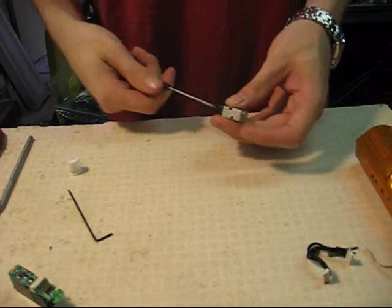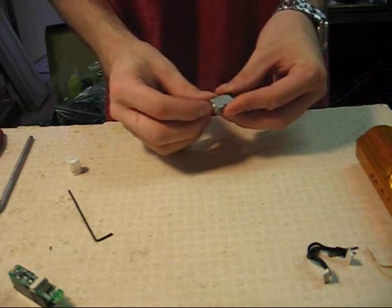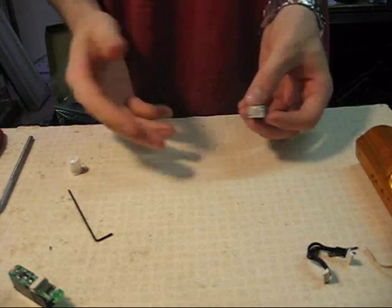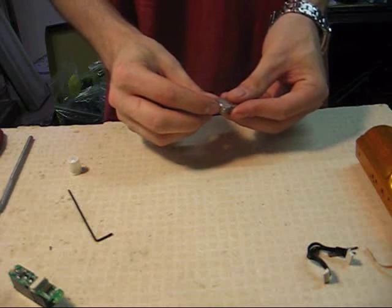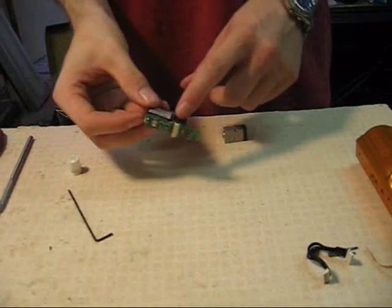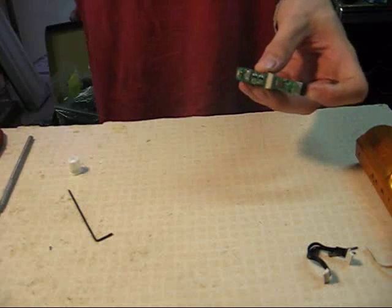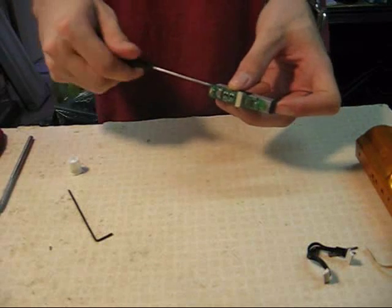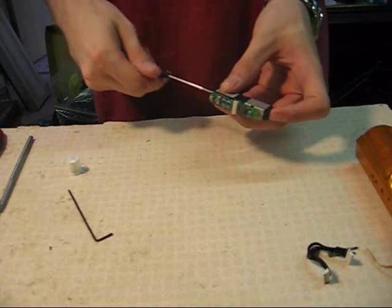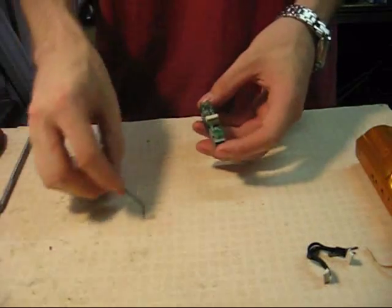With it in position, just screw the screws back down. You can test it to see if it works by pushing in on the other end — it should spring back slightly. It won't spring back a lot; it might not spring back at all, but it should move a little bit freely on its own. Now take the remaining parts of the solenoid — the pilot and the coil — and insert them back onto the spool edge, then tighten that back down. Disassembly of the pilot and coil is not necessary for regular maintenance.